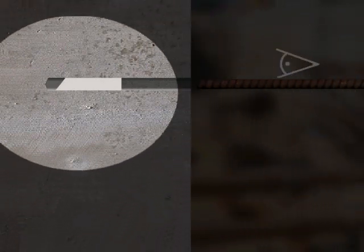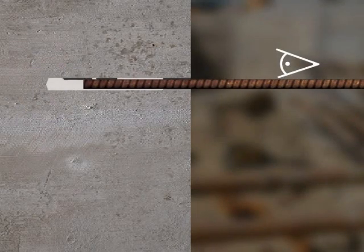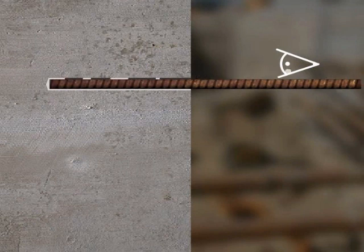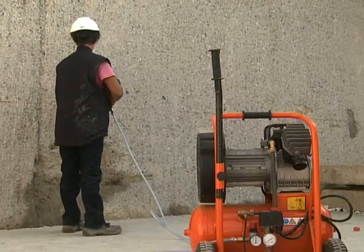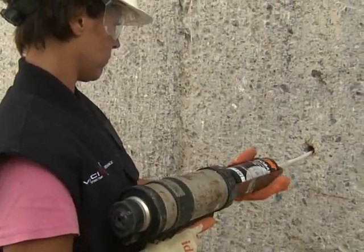If the injection has not been correctly carried out, air bubbles are trapped in it. The main causes are an extension tube that is too short, product coming out of the pistol too fast, or injection without a measuring cap. The consequences are that when the rebar is inserted, the air is compressed — there is a risk of product being ejected into the operator's face. The lack of continuous adhesion reduces the quality of the bond. For a large job, it is essential to use compressed air or an electric applicator.